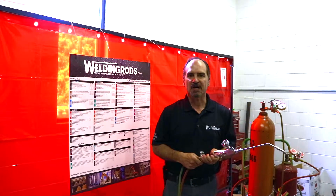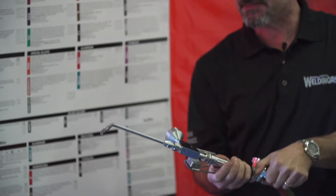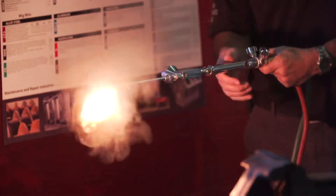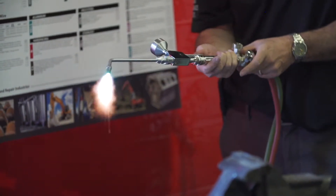So we're going to show you how to light this torch — I'm going to give you a quick demonstration. But before we do, I want to talk about safety. To light the spray torch, what we're going to do is crack your acetylene valve and give it a light. We'll get a little bit of gas going, then add your oxygen, open your valve. You've got a long feather there — hit the trigger and bring it into a cone, then let off the trigger. Now you've got it set properly.